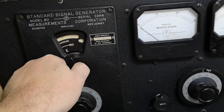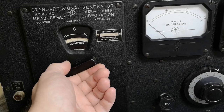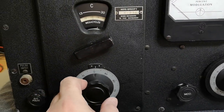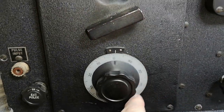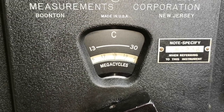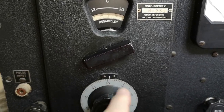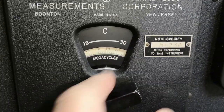There's a very special feel to this bench — something is rolling with bearings and stuff, and then it goes clunk and stays there really hard. I need to use real big force and then it comes free. So this will be the frequency fine adjustment. This is a fine scale that is not in sync with the megahertz in the real world. At 18.0 on the dial it's in the middle of the scale. Going to 19, this is just a relative scale — you're not measuring megahertz or hertz with this one. You need to look at the main scale to know what you've got.